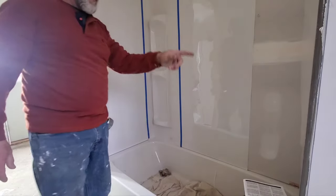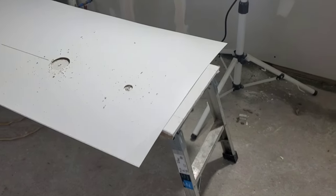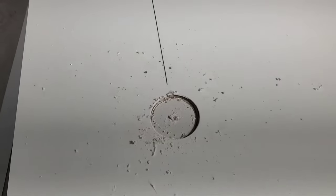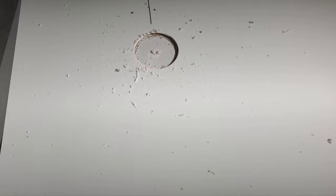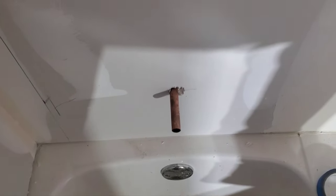That's the one I already put. I should do the plumbing one next. I forgot to record this again — I drilled my holes. I used a cup saw, which can be a little dicey. Make sure there's something behind it for the pilot bit to go through so it doesn't scratch all over the place. I measured it out a couple times — I measured it off the line, from the line here to here, not the corner. The corner doesn't do any good. The edge of your sheet goes there. I'm going to dry fit it before I put the glue on. I'm going to set the other corner in place, let it set. Pushing these — nice, feels good, nice and solid.